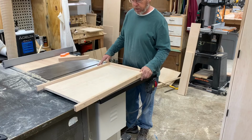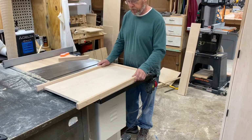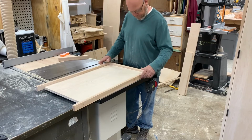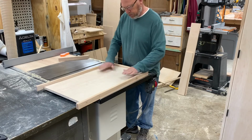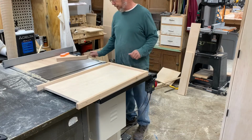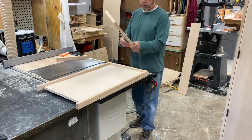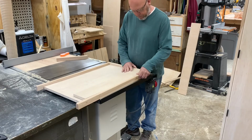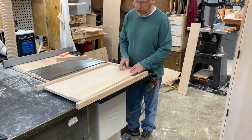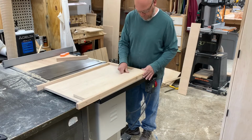The last piece we're working on building is the desk that folds out off the door. So just got a piece of plywood here, and then we're going to frame it out with 1.5 inches on the side. Of course, this will be upside down, if you're looking at the underside. On the underside we're going to have a real 1.5 inches, that makes this, when we do our 3/4 legs that fold out, the legs will fold inside of there.